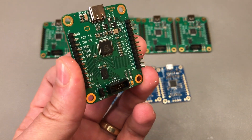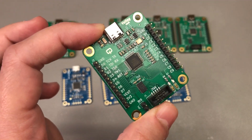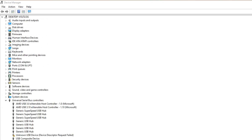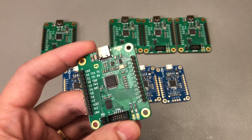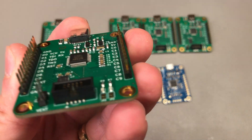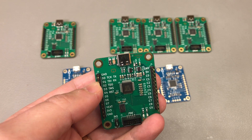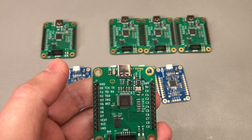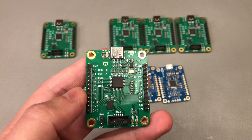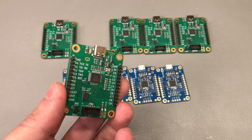You know that excitement when you get a new fully assembled board — you just want to plug it in and see if it works. And this is what I got: 'Unknown USB device.' When I get these kinds of messages I start looking at the USB side, so I checked the USB connector for shorts, checked the data lines to make sure I hadn't made the same mistake twice, checked the fuse, and verified the chip was powered with correct voltages. Everything looked fine — until I tried removing the ESD protection diode, which magically solved the USB issue.